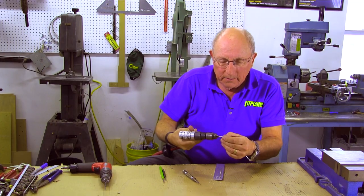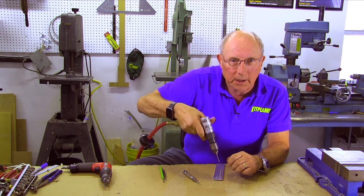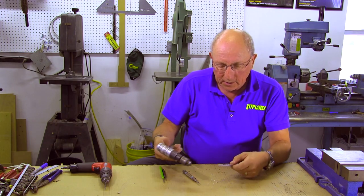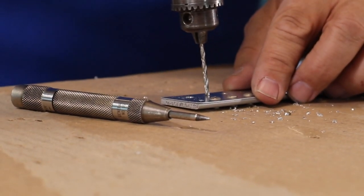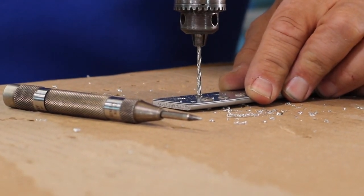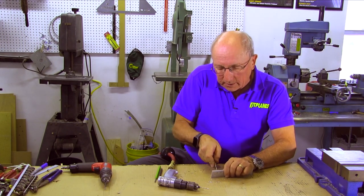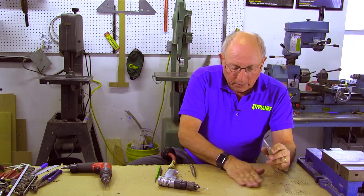Adjust if you need to, don't be afraid to steer it as required to get it right through the center of that rivet. And there, the head came right dead smack off. When the drill went through, that was actually pushing the tail of the rivet out. So we still have a nice round hole, appropriate size to put a new rivet in. We'll do one more — there, the head's off already. And we could just pop that tail out with the center punch. And we haven't damaged the hole at all. That's flush rivets.